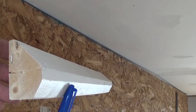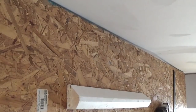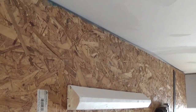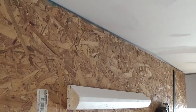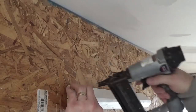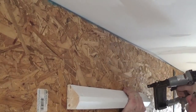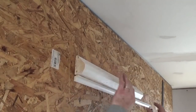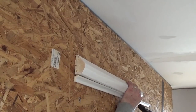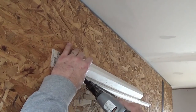The larger of the two parallel surfaces will mount on the wall, and on that edge is where the cove molding will actually be attached. Underneath it'll get a piece of inside quarter round. So there's only going to be maybe an inch of it exposed, and once it's finished off it'll look nice. Here's a little mock-up — it's mounted eight inches down from the ceiling, and this is the inside corner molding that will go underneath it just to dress it up. This is all about looking pretty.